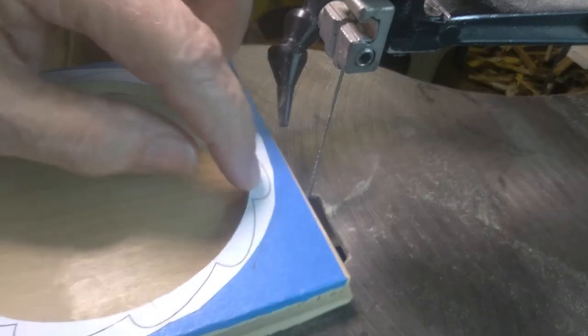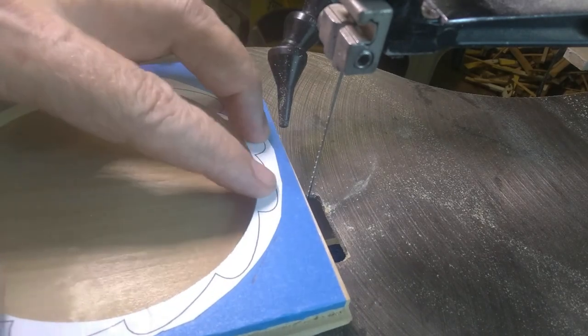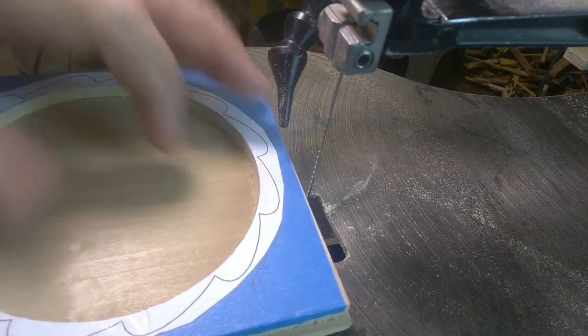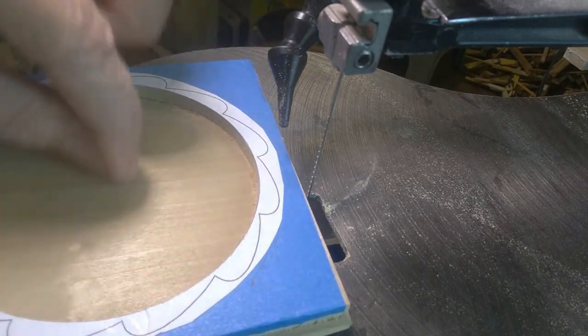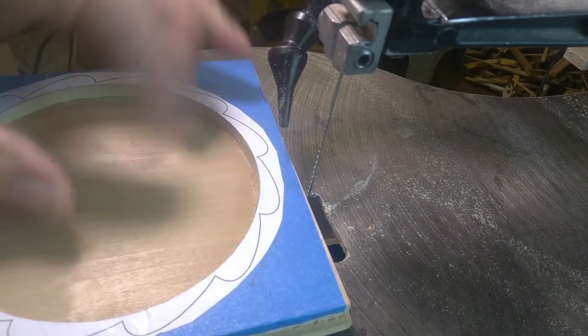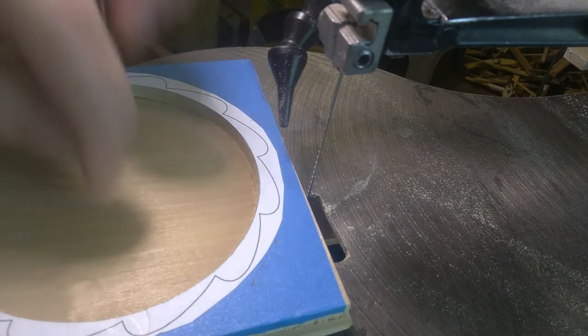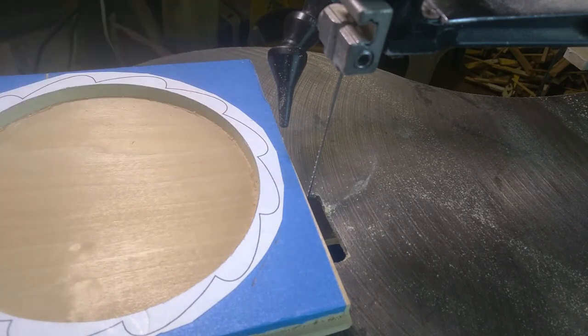Now I'm back to the lid. I'm going to cut these outside lines, which will give me the part that goes over the body of the box. I'm also going to go back, put that piece in and get that center hole cut, because the music box will mount on here and it'll have to have access for the key, the platform turntable, to reach through to wind it.